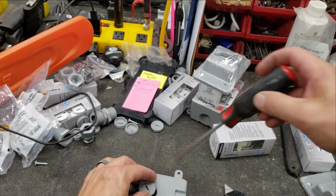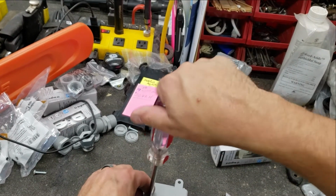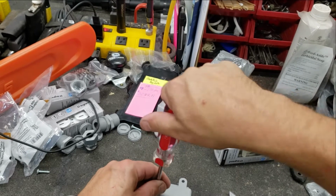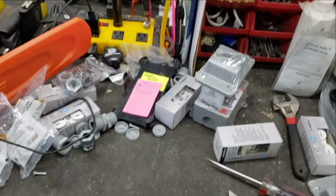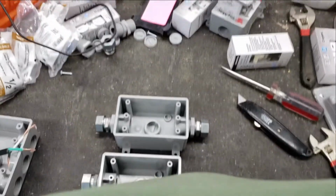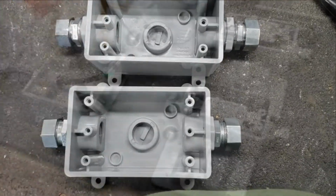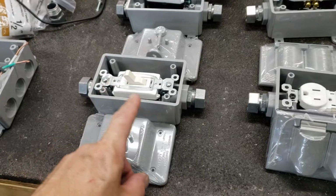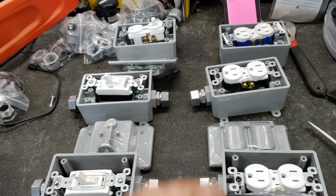So I'm wiring up the same way I've done all my other situations. The lights are going to be LED lights. The fan and the heat lamps are all running at a 15 amp circuit. The heater will be a 240 that I had in there before, and it should be plenty of power for everything. So I've got two sets of 15 amps going into the place, and then a 240.